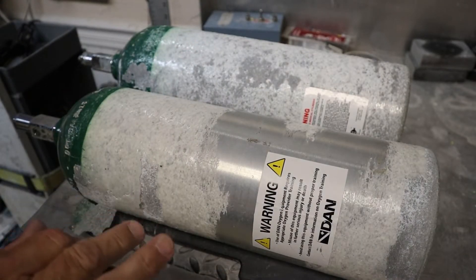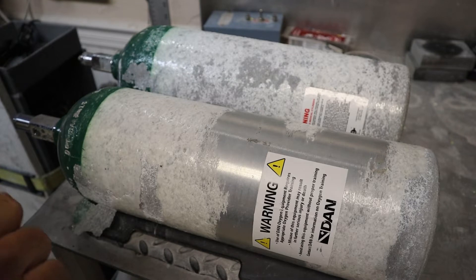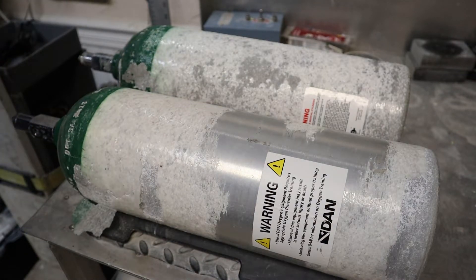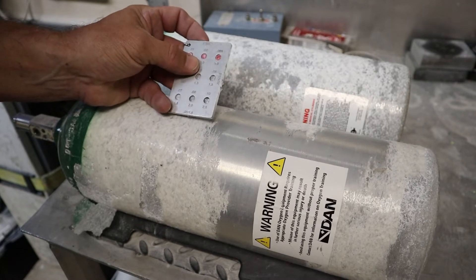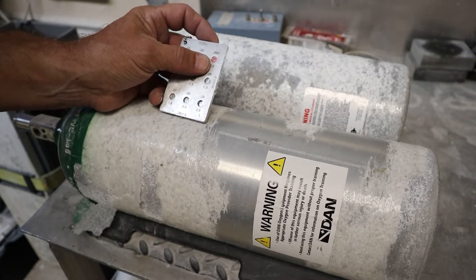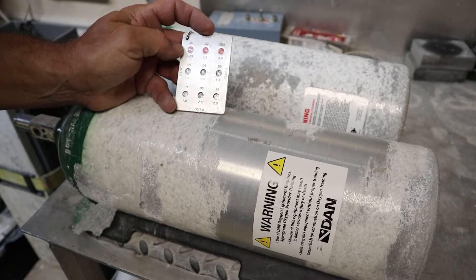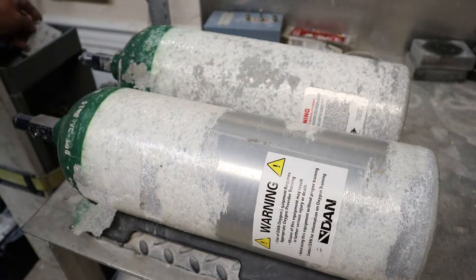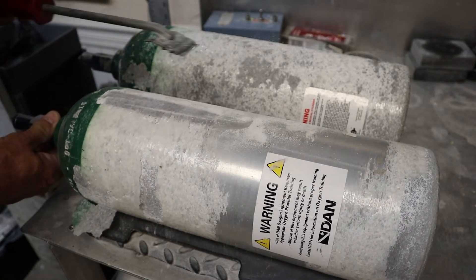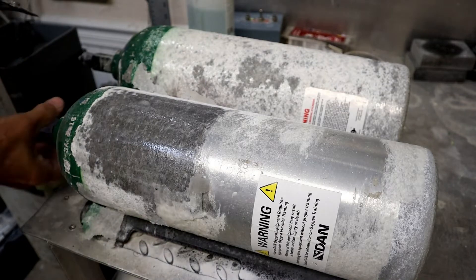As I'm scraping it off, I'm evaluating what's underneath the corrosion — looking at the metal to see if it's been pitted. If it's been pitted too deep, then obviously I'm going to have to condemn the tanks and not do a hydro. This is a pit gauge — it shows me the depth of pits that are allowable. It shows 0.01, 0.02, and 0.035, which are acceptable depths for pitting. Once it goes beyond and hits 0.04, that's a fail. Spraying with a little soapy water helps keep the dust down.